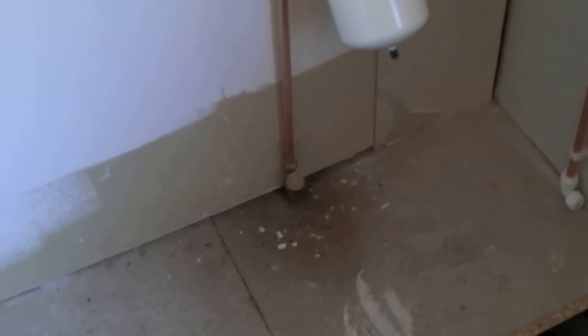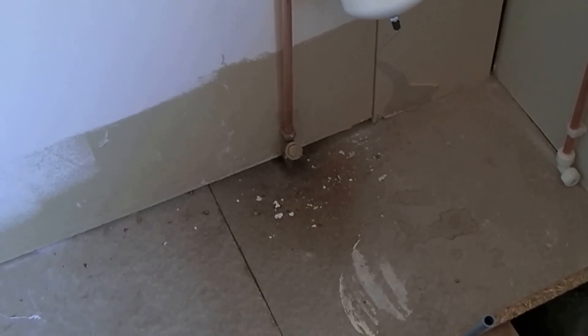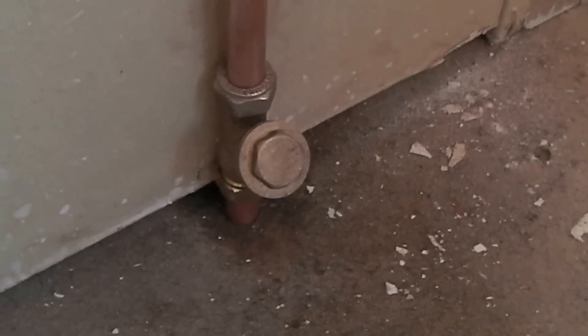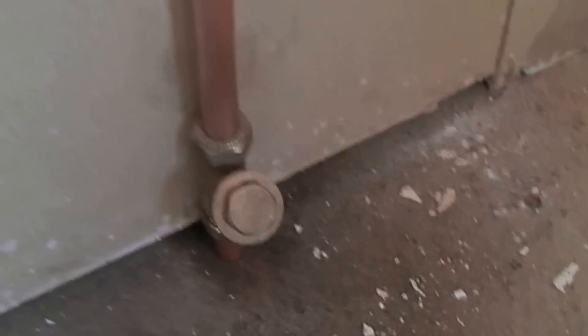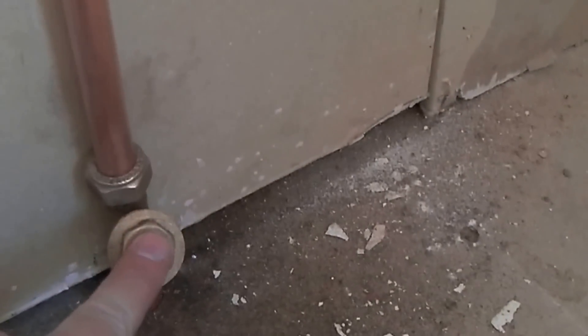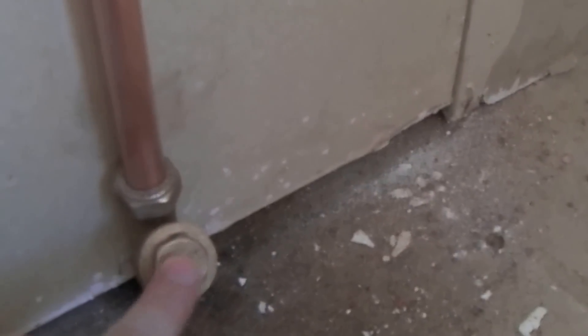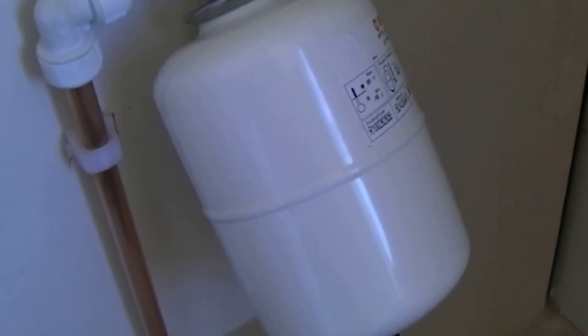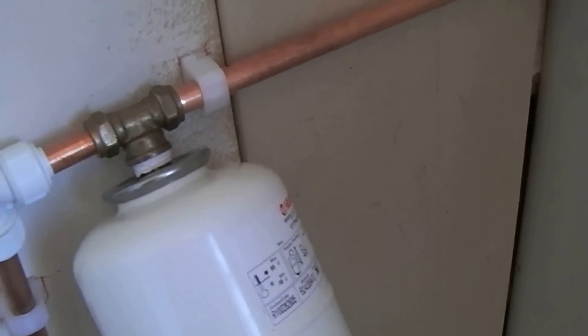Right, real quick update. That 15mm is coming off the water mains in. There's a non-return valve under the floorboards. That is one of those little mesh filter traps, and to clean it you just undo that cap — obviously turn the water off — undo that cap, pour the mesh out and clean it and put it back in. It then goes up into this mini expansion vessel. That was a requirement according to the boiler maker.